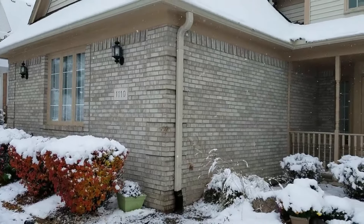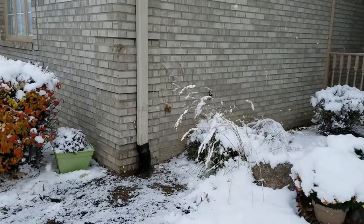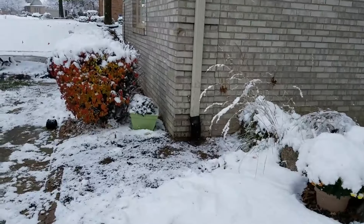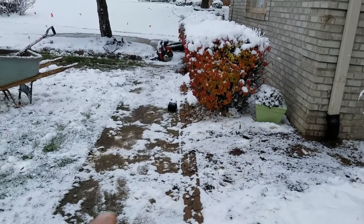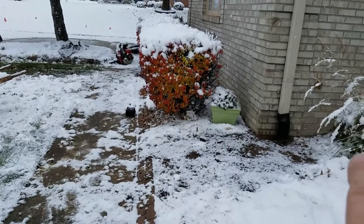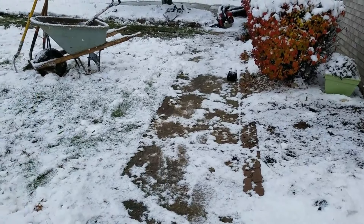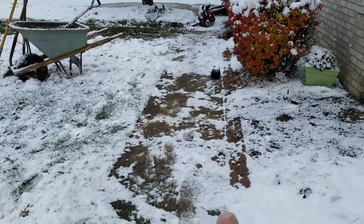When the water comes down this gravity-powered downspout — that's what we have, an underground system that's gravity powered, that's how we're moving the water here — we get the velocity moving and it pushes all the debris right out. With the exception of when it hits a big wall of water, eventually the weight wins. All this water builds up and then pushes real slow, leaving debris behind in this belly under the walk.